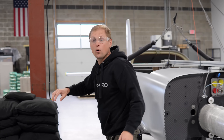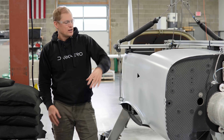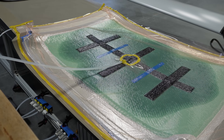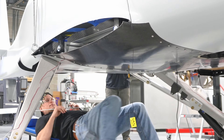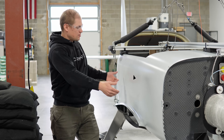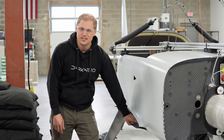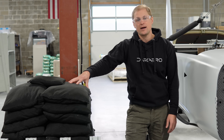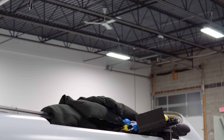You'll notice the wing is missing from the airplane — we took that off for the same reason we took the engine off. We can't just forget about the wing though; we need to replace it structurally, and that's what this little stub wing is for. This is an infused piece of carbon fiber that matches the geometry of the lower wing skin where it interfaces with the fuselage bottom, and that ties the fuselage together. The fuselage skin is structural and needs to have a load path across the belly — this stub wing accomplishes that. The weight of the wing is missing since the stub wing is a lot smaller, so we made up the missing wing weight with sandbags, which also simulate the mass of people, cargo, and fuel.